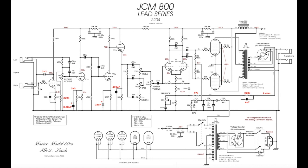Into the cathode follower, which drives the tone stack. The mod here is a 470 picofarad capacitor to ground on that cathode. This dumps a bit of very high-end frequencies to ground, filtering out some of that ice-pick high-frequency content from your guitar signal as it moves through the amp. That is all of the mods to the preamp — only a handful, and not a difficult mod to make to your amp.